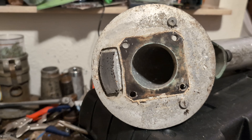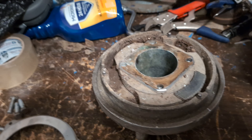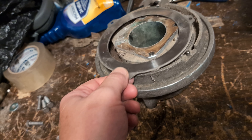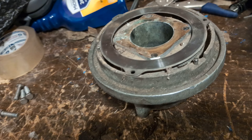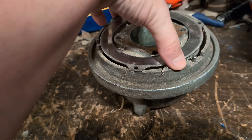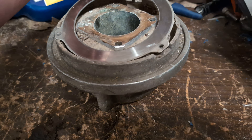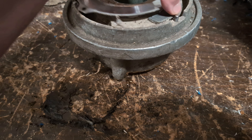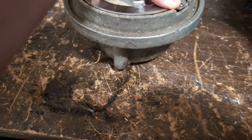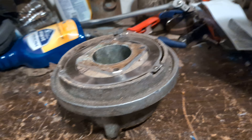I just wanted to show what that was like for anyone who was curious. When I took this apart and saw how it worked, I thought it was pretty ingenious. Sometimes there can be dirt and stuff that gets on the brake disc and causes the gun to seize up a little bit. My working P150 has an issue where after reverse it tends to move really slow until I pass a certain point. I could probably take that apart and see if there's any dirt or dust — it's possible the brake disc or pads might need to be rebuilt.